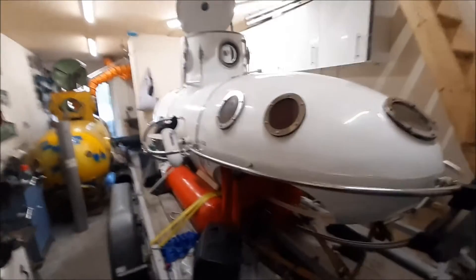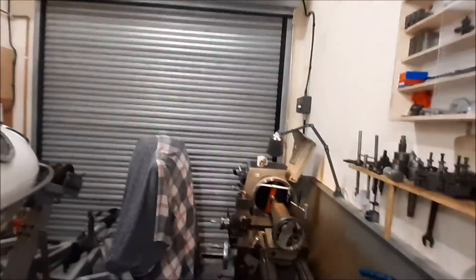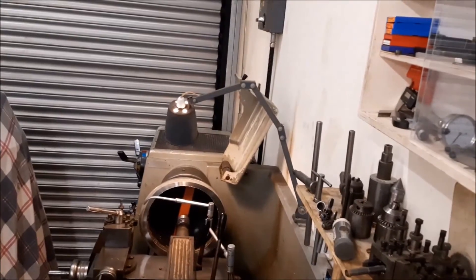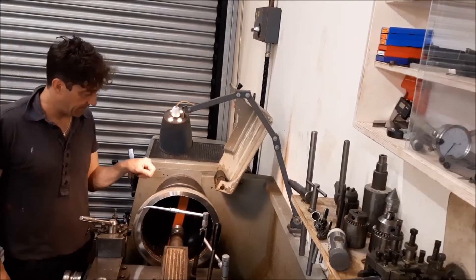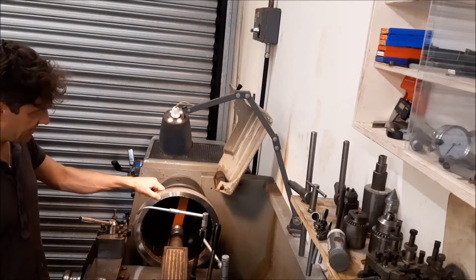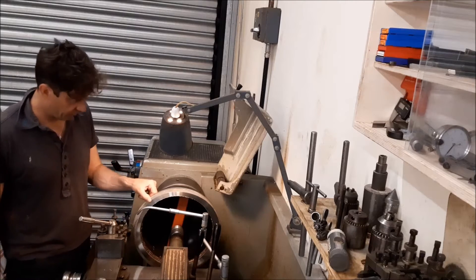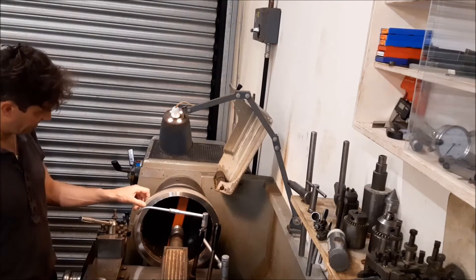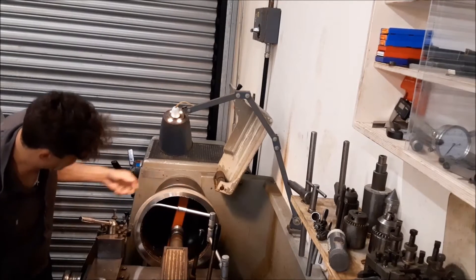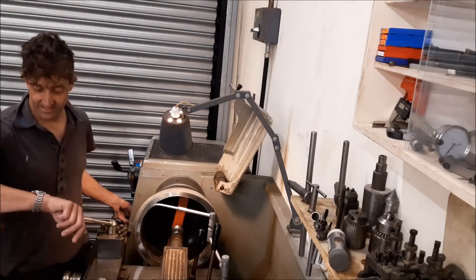I was hoping to dive today but unfortunately the weather's gone really horrible so I've had to cancel that. Also I realized that in the last bit I recorded you couldn't hear a thing, so I'll say it again: one of the reasons I didn't restrain the stainless steel ring — which would have helped reduce warping — is because I don't want to get too much stress into the ring. I haven't got annealing facilities so it's got to be done just like this, and I think this way it won't have as much stress in the part. We're about halfway through, so I'll carry on at 25 rpm and just plod on.